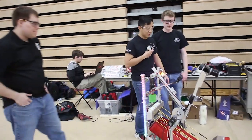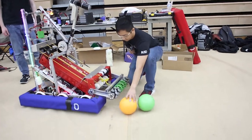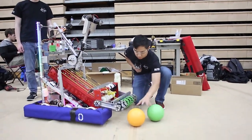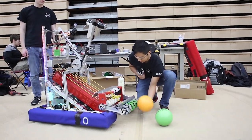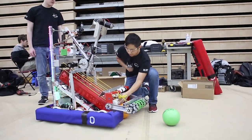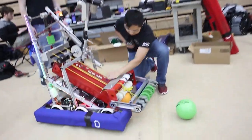Hello, I'm Eddie. First we're going to talk about the harvesting subsystem. Over here we have Mecanum wheels with some green compliant wheels. What it does is that when we drive it to a ball, it vectors the ball to the middle and sucks it in. Then once it gets in, we have our ramping system with polycord and nylon tubing that takes it up.